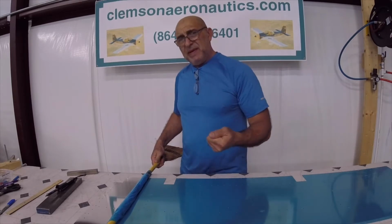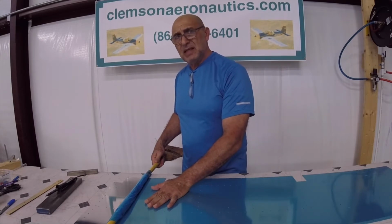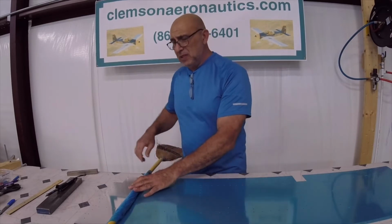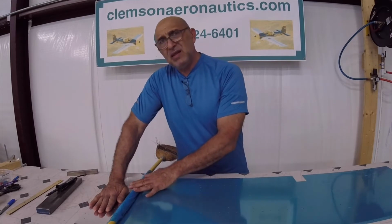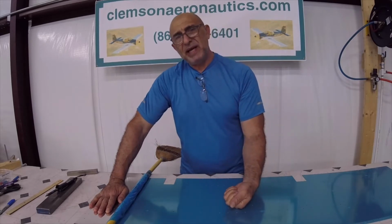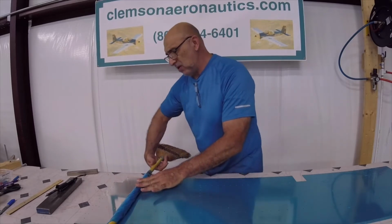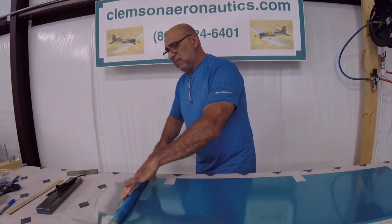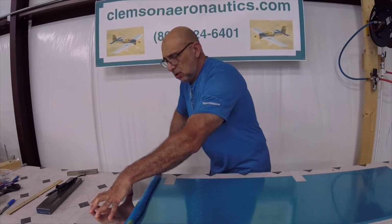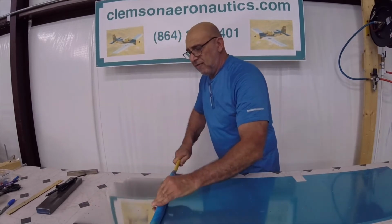While you're ripping that sticker off, you can actually bend the skin. So if you're not going to use a broomstick, try to put your hand on the material and then pull against it so you don't bend the material, and move your hand as you peel some. But I'm gonna go ahead and use my broomstick and still hold it down this way. This way it ensures that it pulls steady in one direction with the entire width of the material.